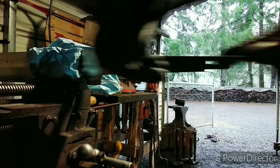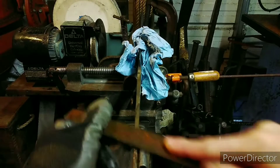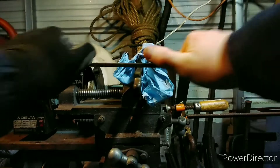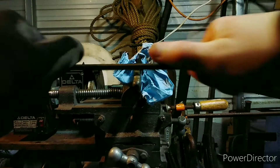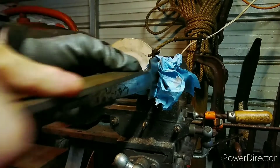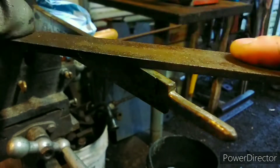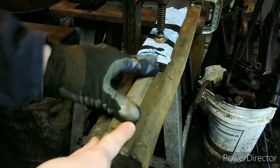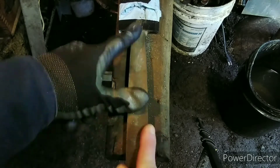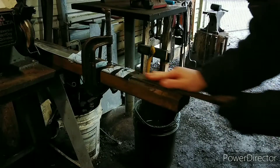Then I'm going to start working on the tang. The tang is still soft because there's no reason to have a hardened tang. I'm going to file up the high spots so it's nice and even for when I put on the handle. I'm also going to file on the flat side of the tang so those are even too, because having an even tang is really important. I never really focused on how important it was until I watched other smiths work on swords.